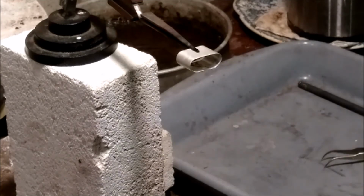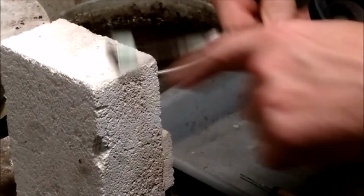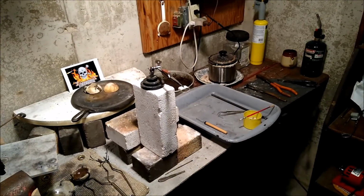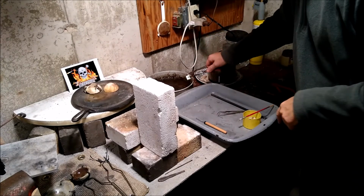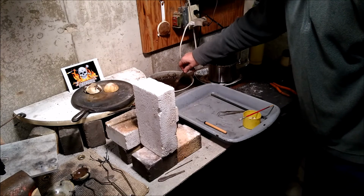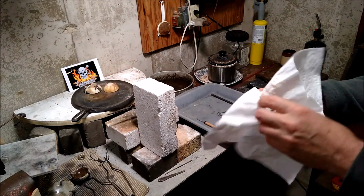Make sure you turn the gas off a second. Alright. That went. Seemed to flow nicely. No solder coming through the other side. This is the side you're going to be looking at. Drop this in the water. Might be stuck there because there's flux on the holder there. No big deal. Drop it in the sauce. Pull it out. Now it's nice and cold. This is the second one. Looks exactly like the first one, more or less.